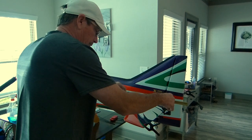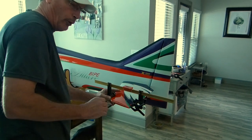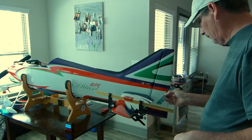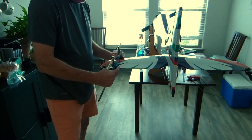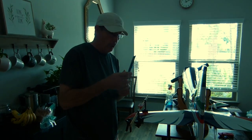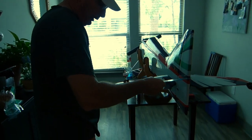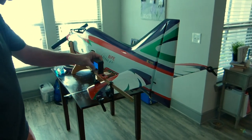Now we're going to recheck the tip. I want to impress you with the fact that you can have a perfect airplane and how to achieve that. Part of the problem is that to get accurate measurements all over the airplane, you have to use the same bar, the same arms, the same mount — everything. If you change anything, if you use two meters or two bars, there's an influence of small differences. One-tenth of a degree is a lot on an airplane. So I try to use the same bar, the same mount, the same tool — one of each. That way I know for sure I'm getting accurate readings.